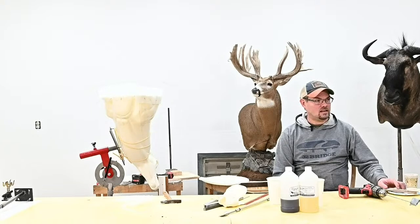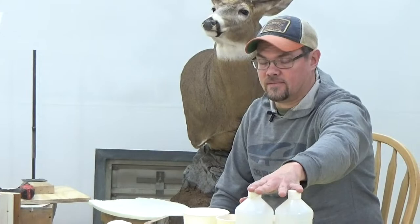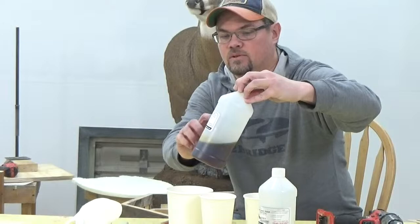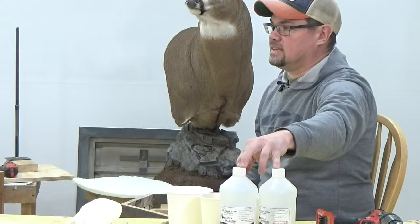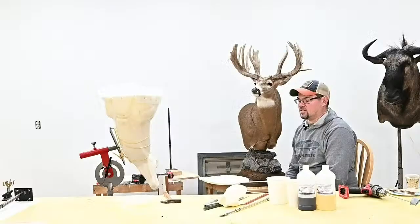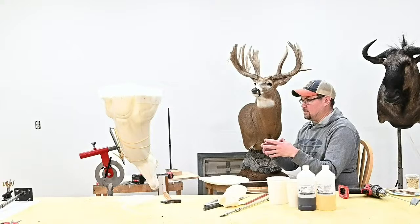We have 10-pound density foam, which we often refer to as structural foam. It's still a two-part foam. Looks exactly the same in the bottle, but you'll notice it's labeled structural, and we sell it that way. 10-pound density foam is really strong, and we could put our pedestal attachment in with that foam. We could foam it into place with that, and that's nice and strong. We may or may not, depending. But it foams a little bit.